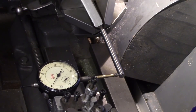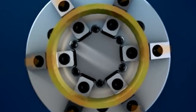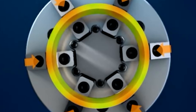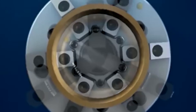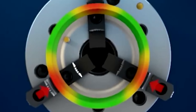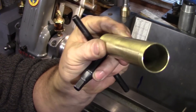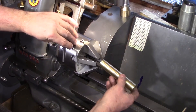So you may be wondering what is the purpose of this six-jaw chuck? The fact that it has six jaws means you can hold things with a lot less pressure — especially things like thin-wall tube which can be quite fragile and prone to getting crushed by a three-jaw chuck. The six jaws and longer reach mean there is less pressure exerted on the outside of the tube but still gives a good grip.